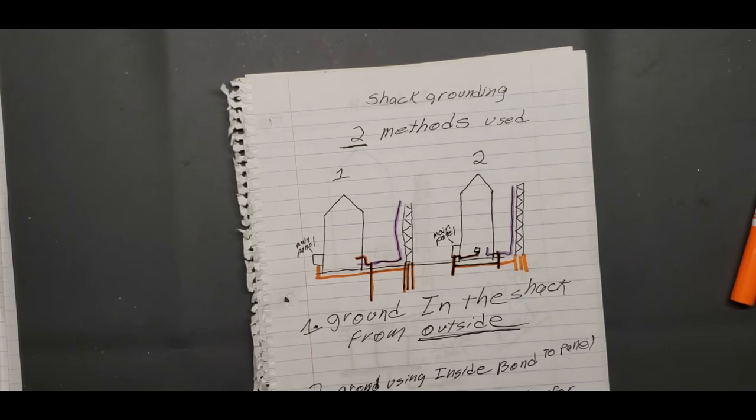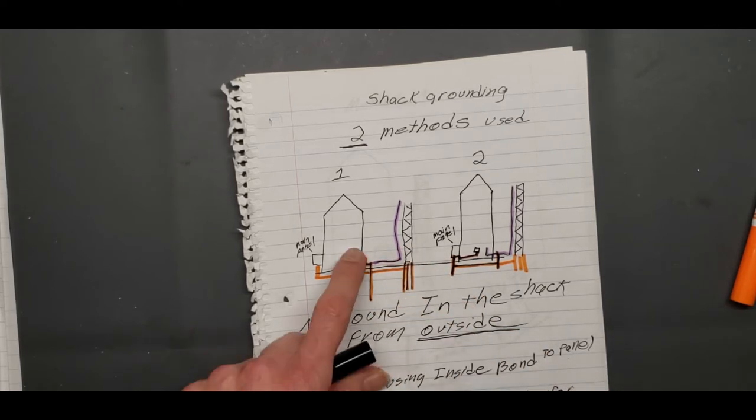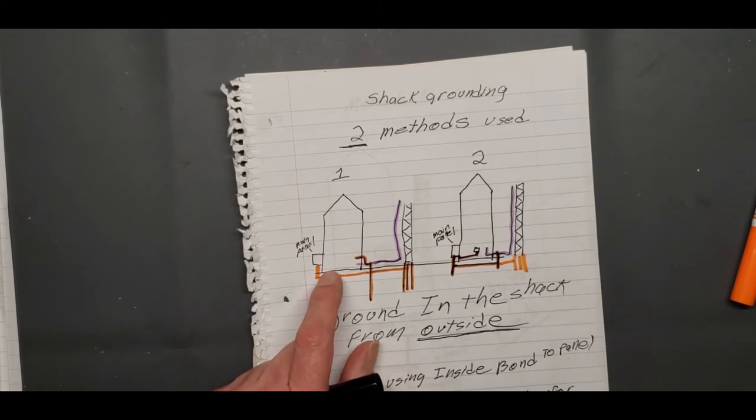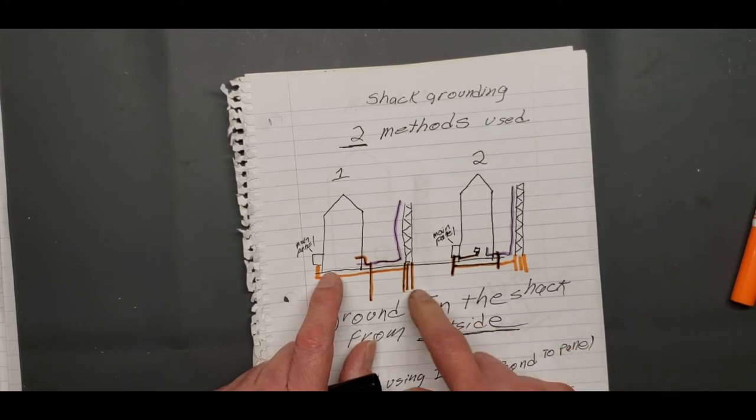According to the rules and regulations, that's a no-no. It creates ground loops, and that's a big problem. Because you're plugging your equipment into the electrical outlets using that ground. And say you plug your power supply in, even though you're bringing that ground in and you're running a ground strap up to it, you're creating a ground loop. And that's what you do not want to do.